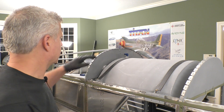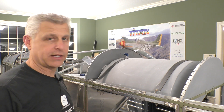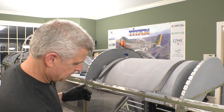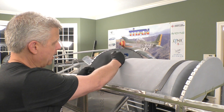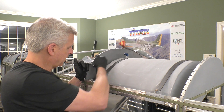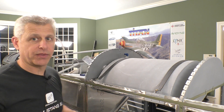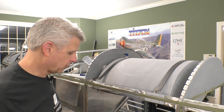Now I can actually go and start forming the tube and tubing to go where I need it to go. The best way to do that is first to straighten it out, cut and get my lines set up for the length I'm going to need, and then feed it up and bend it to where I need it to go. I'm going to secure it so it has some support going down there, and the most important thing is that we have it routed so that as a vent, it's as high as possible in its routing.